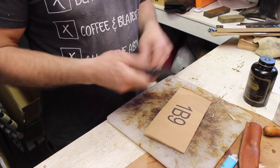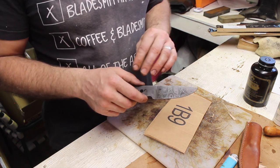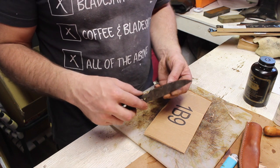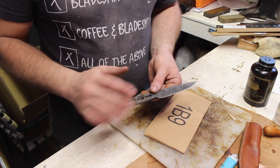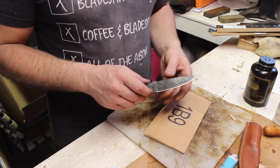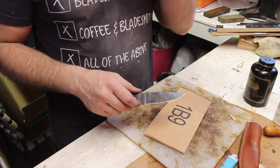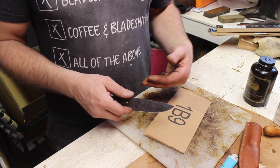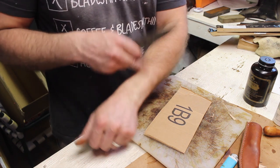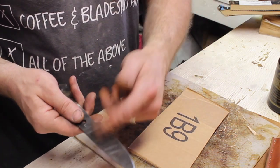I used a different knife to cut these pieces, so these are the first cuts with this knife. The blade is completely finished — after this I'll probably go back and touch it up, make sure the Damascus contrast is still nice and pretty. The only thing lacking right now is the handle scales. To sharpen the edge, I did the same thing I always do: put the initial bevel on with the belt grinder using a fine grit belt, then took it to the wet stone with oil, then the Arkansas stone, and finally the leather strop — probably eight to twelve times on each side. We have an edge that will easily shave hair off my arm. Very keen, very sharp. Great edge. Let's see what happens.